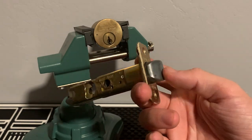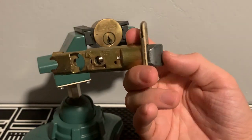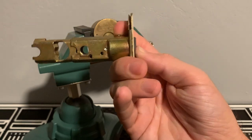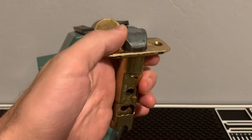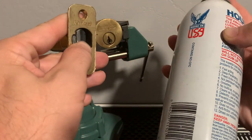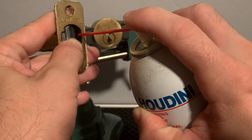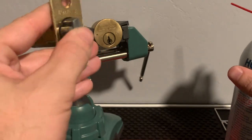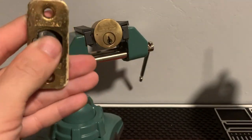If the problem is still happening and it's not over-tightened and not loose, you could also have the issue where you turn your knob and the latch only partially retracts, or maybe it doesn't come back out. In this case, push with your thumb and press the latch fully inside, take your lubricant — in this case we'll use Houdini — use the straw, place it just inside, give it a nice little spray, and work the latch in and out. You can also spray around any areas you can get the lubricant inside and keep doing this.